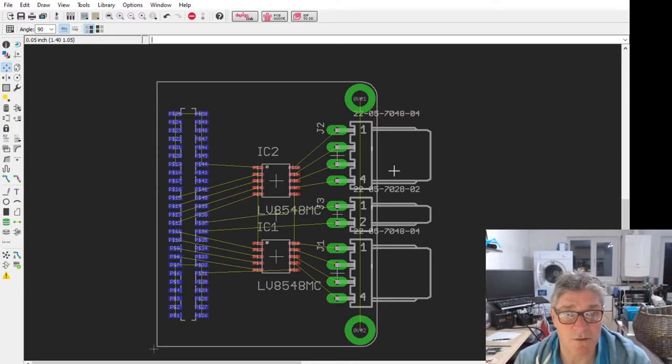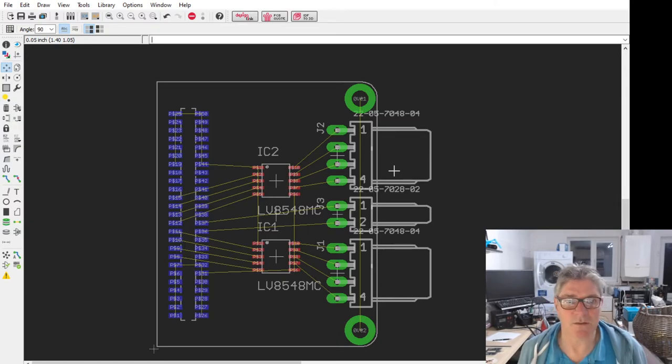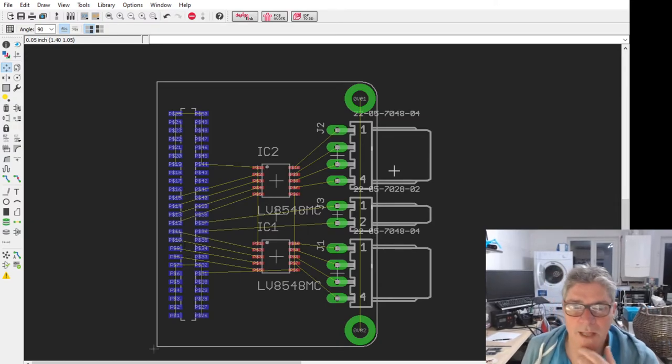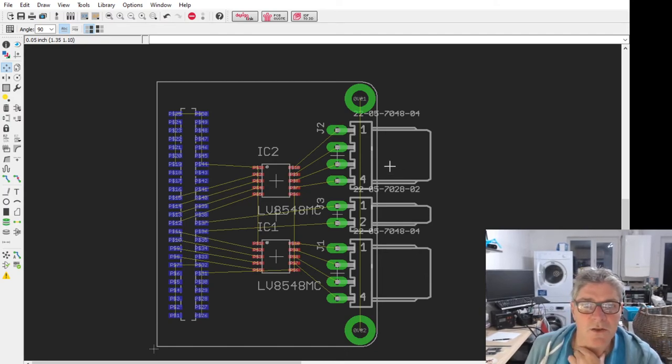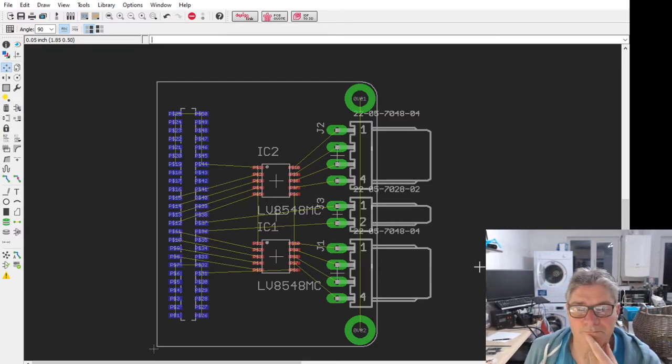Particularly if you do automation stuff or robotics, you've always got lots of stuff coming in and out. You've always got wire connectors connecting from one connector to a motor or to an actuator or to a switch or to a sensor or to an IR LED or any number of different things. So you need good spacing around edges in order to fit in all your connectors. So it's nice, neat, but it also has to be robust as well. So you need a robust connector. So these Molex ones not only have a polarity, but they also click into place. They kind of snap into place when you put them in, so they don't easily vibrate out.